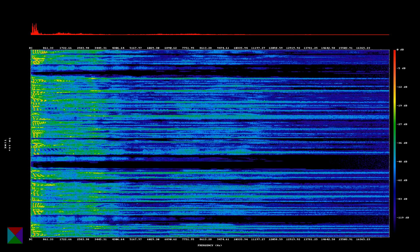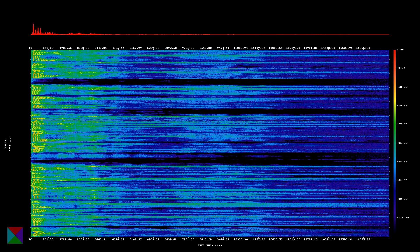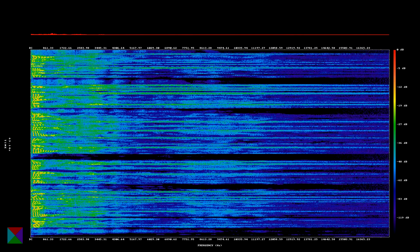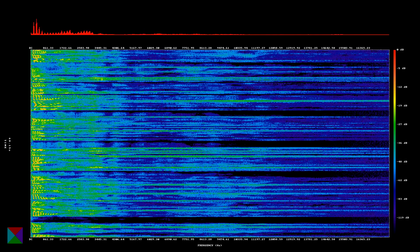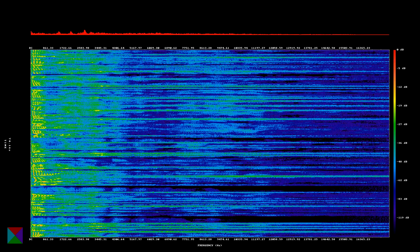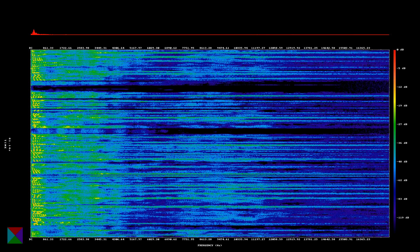You can build on that by using your radio to transmit that sweep, and record the result using a receiver. In my initial experiments, I used an RTL-SDR dongle to receive the audio with some success, and a boatload of spectacular harmonics. But I wanted to find a better, more accessible way to do this, and during the week I realised that my Yaesu FT-857D sitting in my shack is connected to a perfectly functional antenna, and with a few settings it could do the job perfectly.